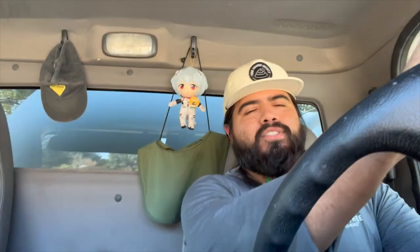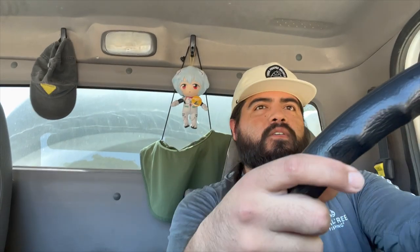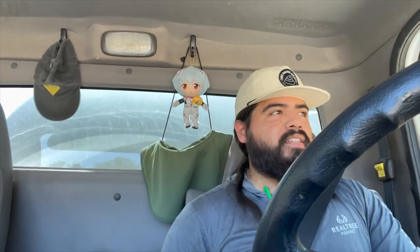But yeah, that does it for this job. Got both the lids popped open. I flagged it for the customer, and I'm gonna do an inspection report. So what that entails, I'm gonna mark the location of the tank. We did a function and flow test to make sure the drain field was working properly. And it's gonna include pictures of everything: the clean out, top of the tank, inside the tank, all the baffles inside of the tank, the PVC. That way, whoever purchases the property will have the peace of mind that they are buying a property that has a properly functioning septic tank.